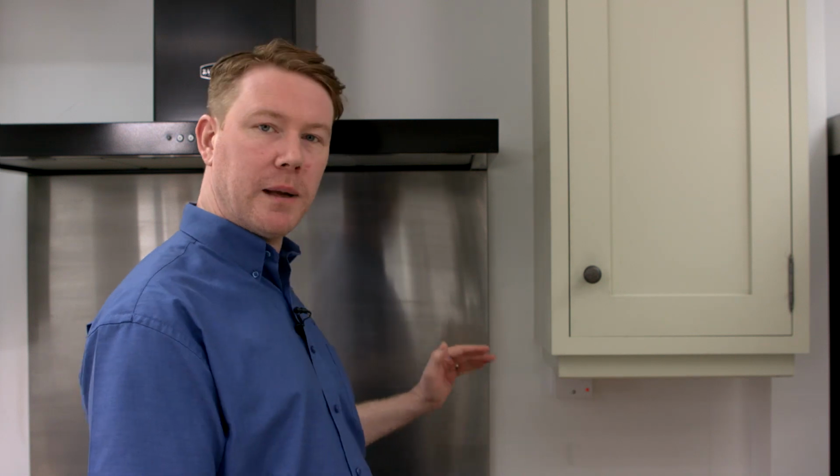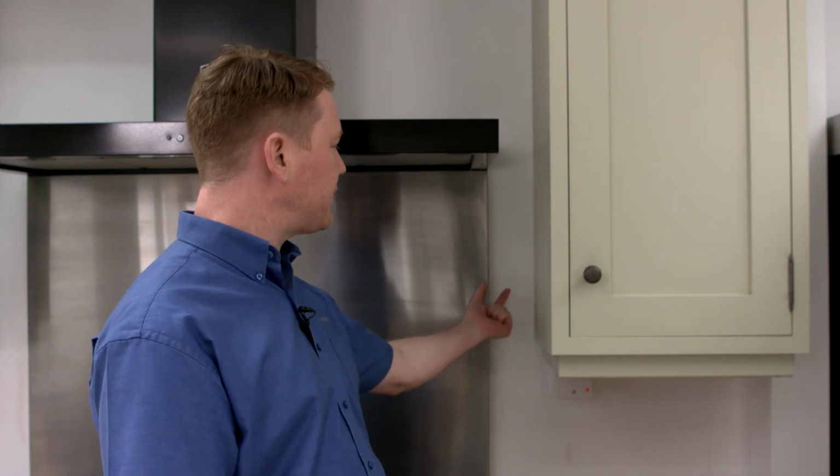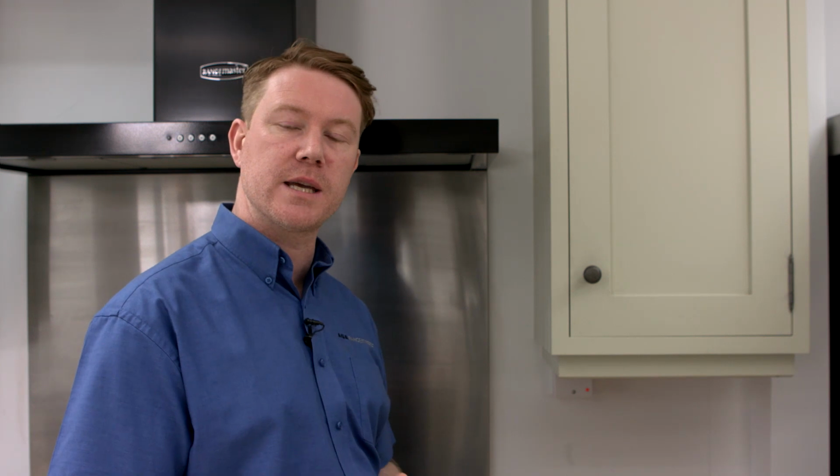Plug sockets like this are in an unacceptable position and would need to be moved by a competent electrician. The cooker must have side clearance above hob level of a minimum of 75mm up to a height of 410mm. This can be reduced to 25mm for non-combustible materials, but please do see your installation instructions for guidance.